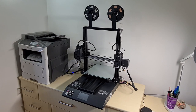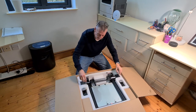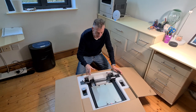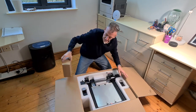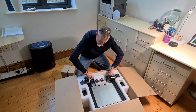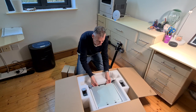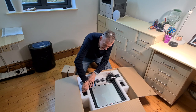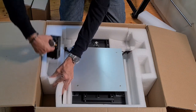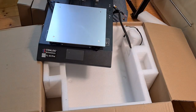We're going to go from this to this. To start off, take everything out of the box. You've got your two printer heads, your rear stand with the carriage on it, which will also support the spool holders for the filament. There are two boxes with filament and accessories. Take the glass off the heat bed so it doesn't get broken, then take the printer heads out. I recommend cutting the packaging so you can prise it back to lift the head out without damaging it. Now take the base out.